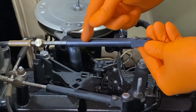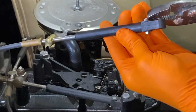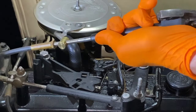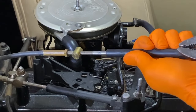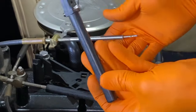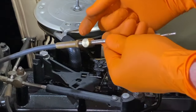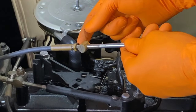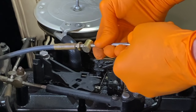From here, we need to remove this end plastic piece. To do so, you have two set screws that are square shaped, one on each side — we need to loosen those. In most cases, most people don't have a wrench that small, so grab a pair of pliers, carefully grip the set screw, and loosen it. This plastic end piece should slide right off. Next, you have a jam nut right here. If you can loosen it by hand — which surprisingly we could — go ahead and loosen that up. If you can't, I believe this is a 10 or 11 millimeter nut. As you loosen this, grab ahold of this portion of the cable housing with a pair of pliers. What we'll do next is unscrew this threaded shaft from the housing.